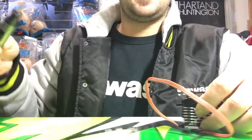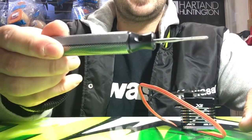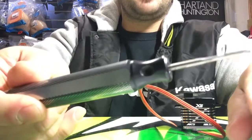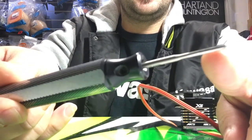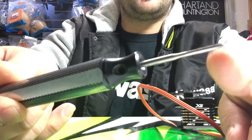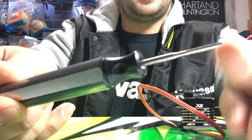I push that on like so and leave it like that. With the tap, I just use an allen key handle instead of the normal key tip. It's a tapered tap at the end, so make sure you get that type — that way it'll cut into the standard thread a lot easier.